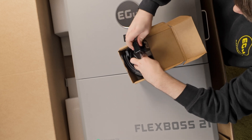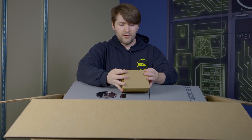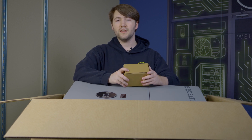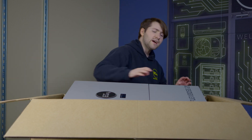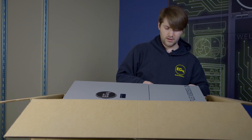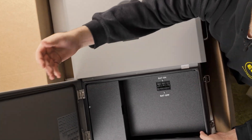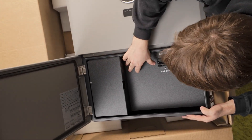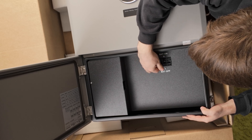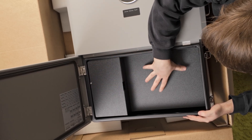We have CTs in here for if we want to utilize this as a 200-amp service hybrid inverter — we will need to have the CTs in order to read the input and output of the grid bus. Because this inverter is made for two people to put on the wall, it is very heavy. I'm going to just pop the box here and show y'all a bit of what's underneath from our top view. We start off with this plate that goes over all of our open system, so once you install it, you have access to your important breaker, which is your battery on and off to power your system. But you can protect yourself from all of the non-breakered things in here.